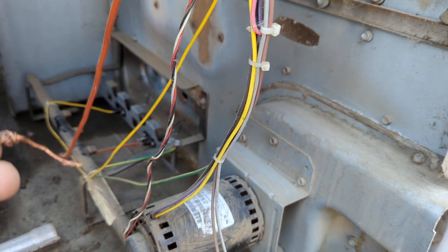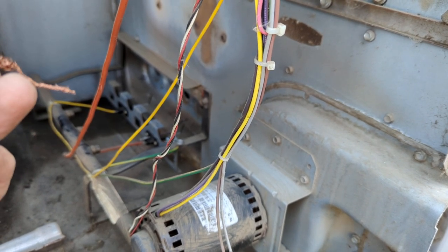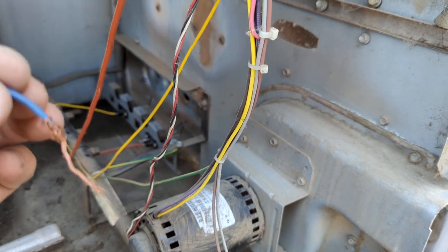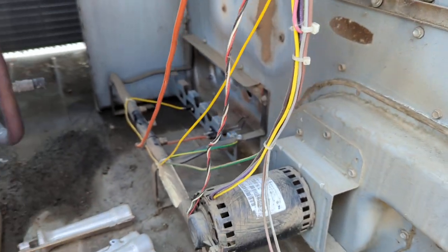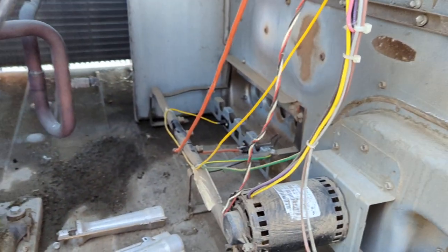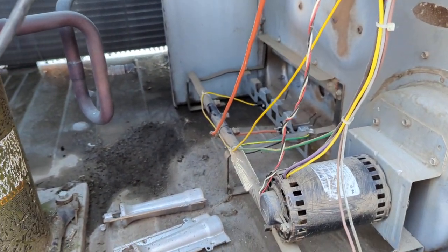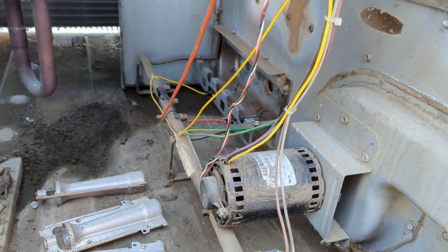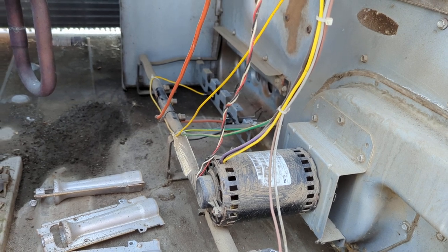You see how I got it a little mangled at the end — I want it to be mangled so that when I'm twirling it, it's grabbing all the cobweb out of there. That's one way to fix a heater that might only have one burner not coming on, or if none of them come on — that's what you'd have to inspect.